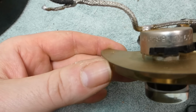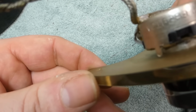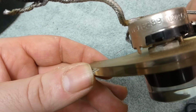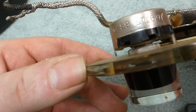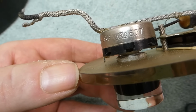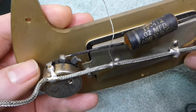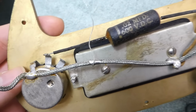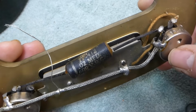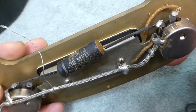Okay, we got pot codes visible. And again, these 40s pots are really stoutly made. So, something like VC16289 would be the component part. IRC is a manufacturer, 607, I'm taking to be the 7th week of 1946. Also, we have a 0.02 microfarad cap, oil and paper. I don't see anything seriously wrong. I'm just hoping that flushing out the pot's going to cure whatever ails it.